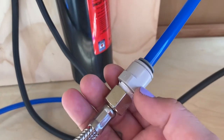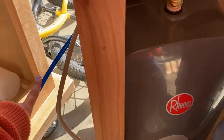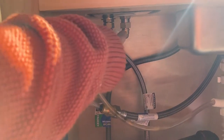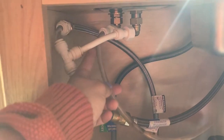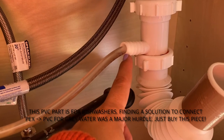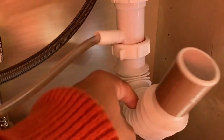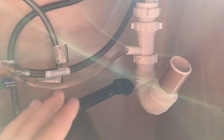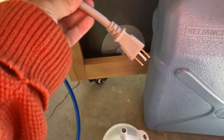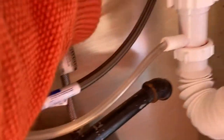So my fresh water tees off from the filter and goes straight to my espresso machine. This adapter right here is super important — it comes with your machine from Clive Coffee. Then it tees off and I have fresh water going to my second cart as well. The water line then tees off two times: one time it goes to the cold water for the hand washing sink, and the second tee-off goes to my pitcher rinser. The pitcher rinser has gray water coming out and going here. This is a PVC connector — it's actually for a dishwasher, but it's perfect because the PEX fitting goes in perfectly. The health district cares about this space here, and this is pretty much a perfect fit. I just shoved this PEX line far enough down that the gray water doesn't splash. Then I have the line continuing on to go into my hot water tank.